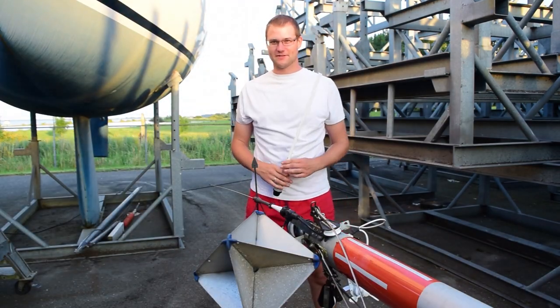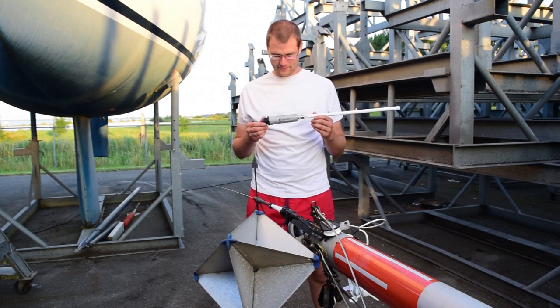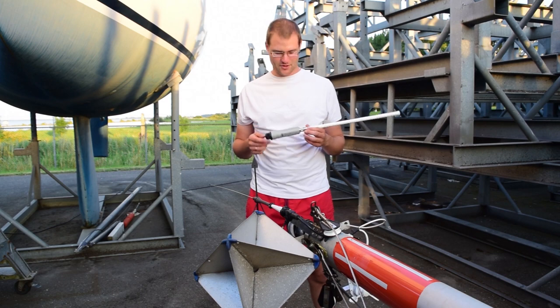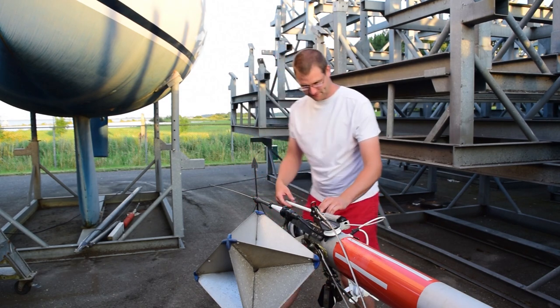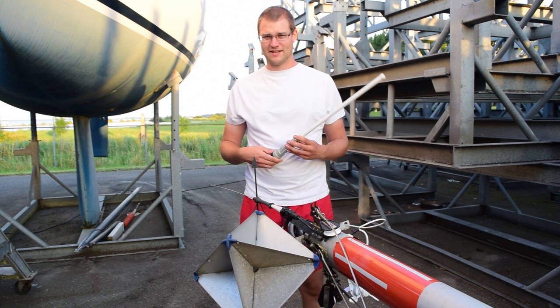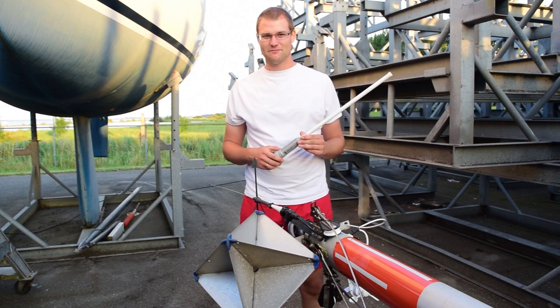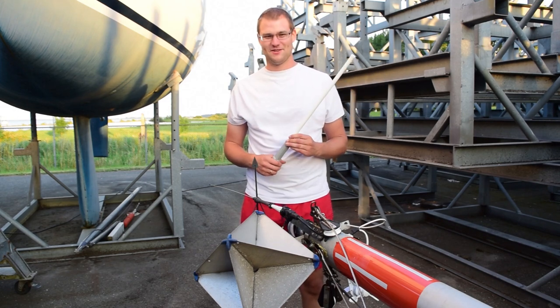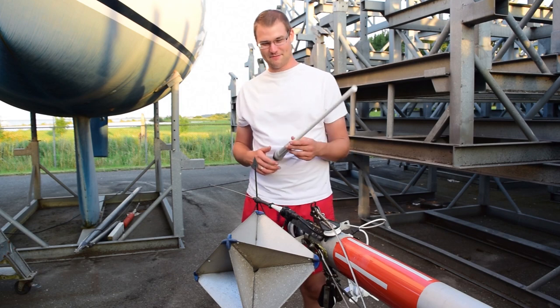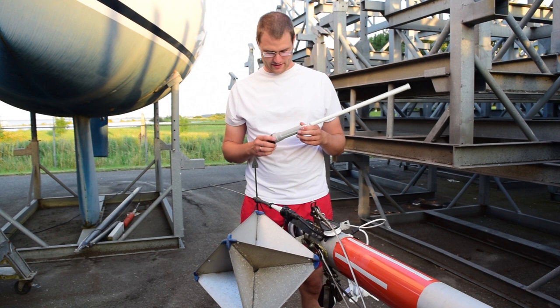Okay, Tuuli is going in the water tomorrow, hopefully, if the harbour master understood everything correctly. And the last thing that we will do is install the Ubiquity bullet at mast top, somewhere here. The discussion about where to place the Wi-Fi antenna is as alive as it could be, but we're going to place it at the mast top. We have easy access to it via the mast steps, and we like the reach that we have up there.